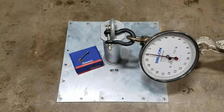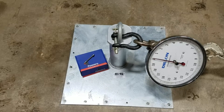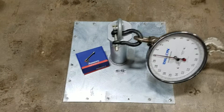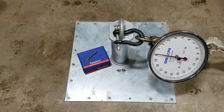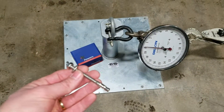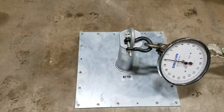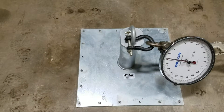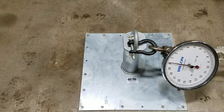This is an engineered supply field test and failure load test of a wide plate pipe anchor with a Powers SD4 Plus fastener. That's 304 stainless steel. There are 20 fasteners, a total of 24 holes. We leave one hole open on each side of the fastener to allow for field interferences.